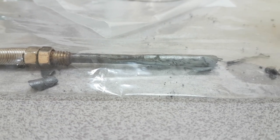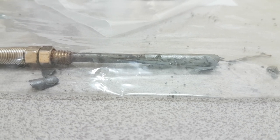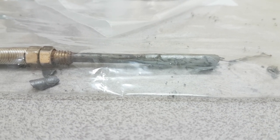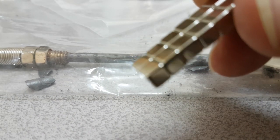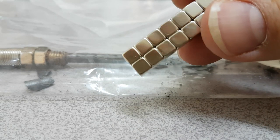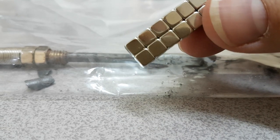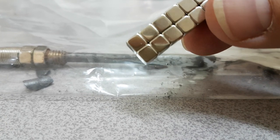This is the Lion 4 heavily damaged thermocouple in this plastic — you'll see why it's in the plastic in a second. What I want to do is a magnetism test. I have this lovely set of neodymium cubes here, and of course it's meant to be a stainless steel sheath, so it should not be magnetic.